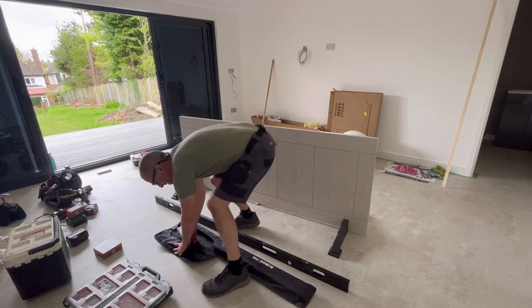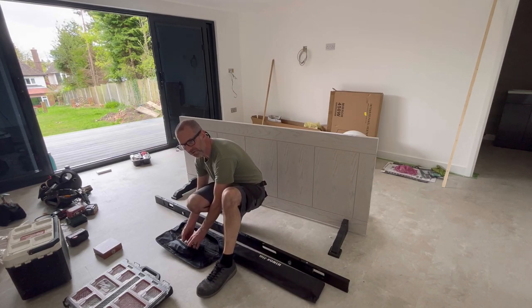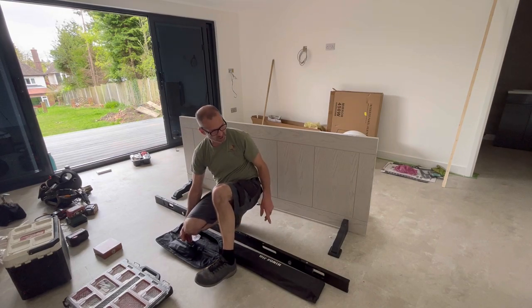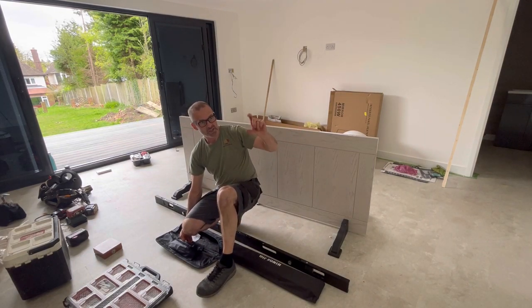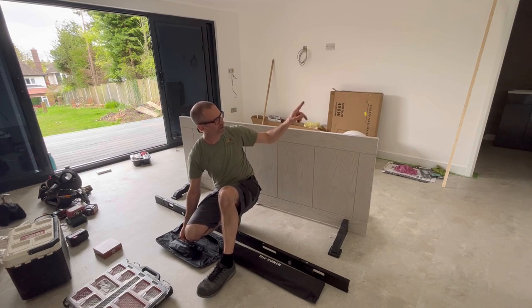Because it just makes it easier, in my opinion, when doing new doors on old hinge holes in a frame. You can set it to your frame with your stepped collet and spacer and then transfer it to your new door, whereas with this one you have to try and hold the packer on and line it up.